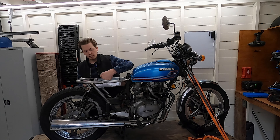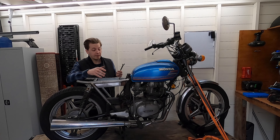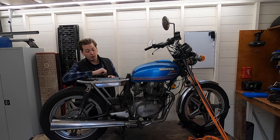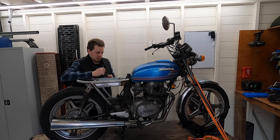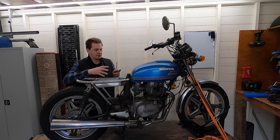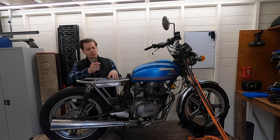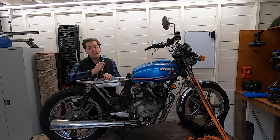It's in. It's definitely not the prettiest but if I had more budget I would definitely use some steel bungs — it would make life easier and be more secure. But I don't think it's going anywhere. I'll probably put some Loctite on here just in case so vibrations don't loosen the bolts. The box is pretty stuck within the frame as well, so in combination with four eight millimeter bolts that would be absolute overkill. Happy that this is finally done — let's move on.